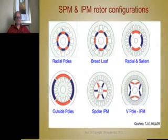So this is a full pitch. Take the number of poles, divide it into 360, and that'll give you the mechanical pole angle. Electrically, if you multiply the mechanical angle of this pole arc by the number of pole pairs, you'll get the electrical angle of this. So here's a case where arc magnets are used. They can be ceramic or neodymium, though you probably wouldn't use ceramic on the OD of a rotor because you wouldn't get enough flux out of it.